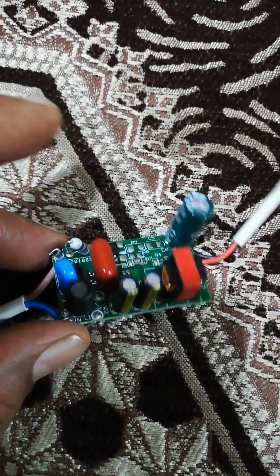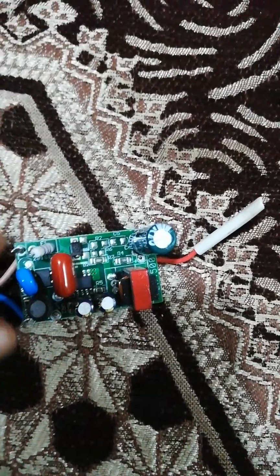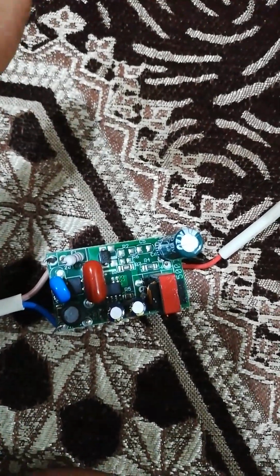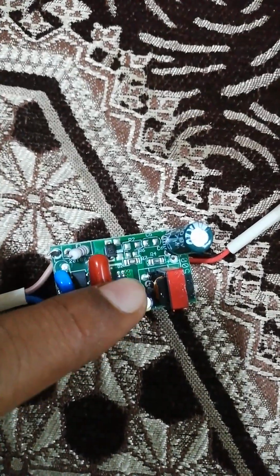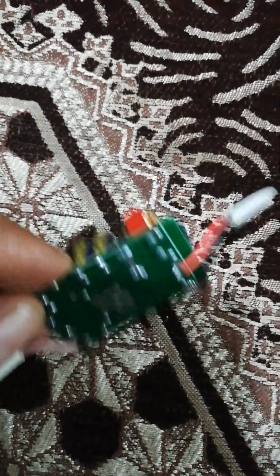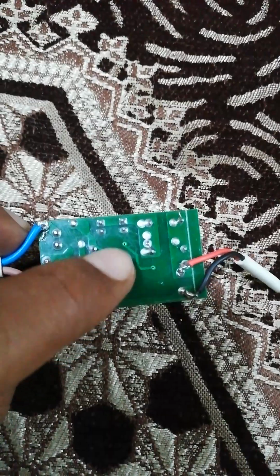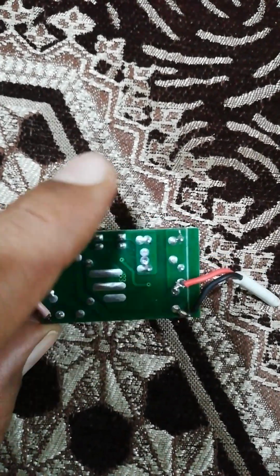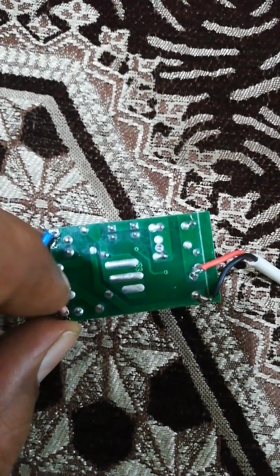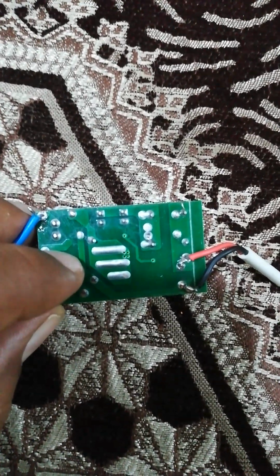Fine. So with that said, most of these components we have got the basic understanding. This module is about basic understanding of how to inspect the PCB. Obviously, on the top of the PCB, I see the tracks in green. Those are the tracks to carry the current. And on the bottom side of this PCB, you also see these greens are the tracks, and the silvers are the soldering points. The components on this side have been soldered on the bottom or the other side of this PCB. So this is a two-sided PCB, because the tracks to carry the signal voltage or current are on both sides.